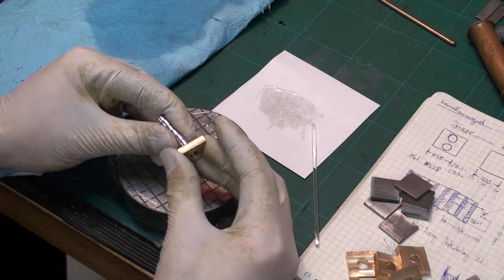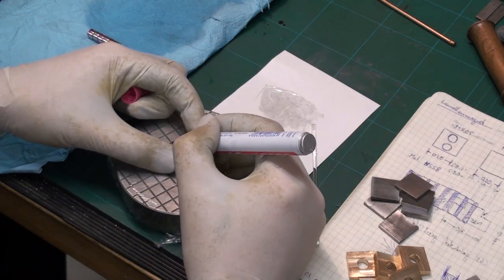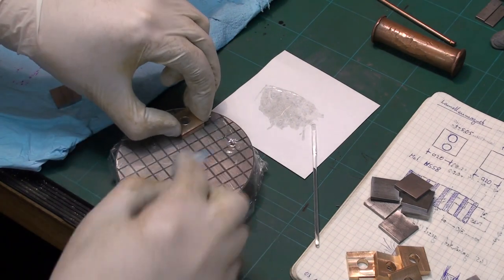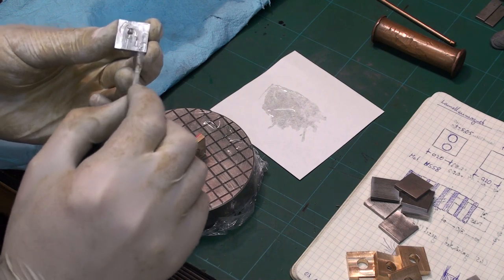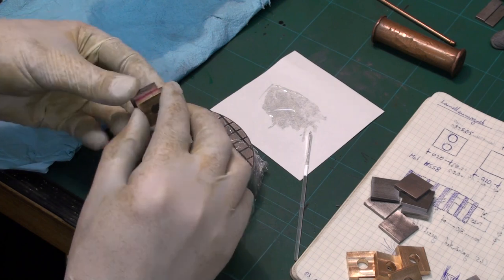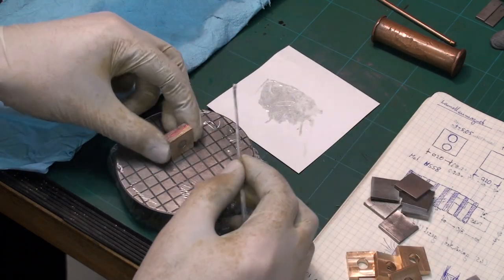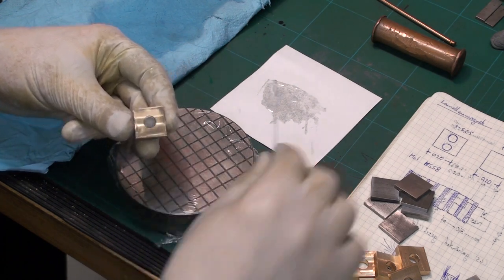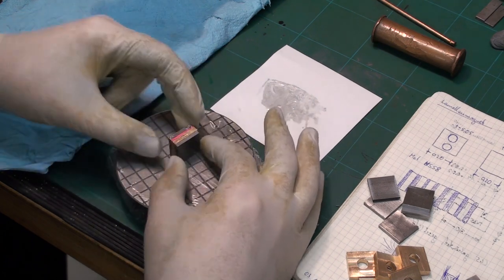And we drilled them pretty close, I realize. We might have to use a little help. But before we do that, I will mark the polarity on the brass too, like this. Now we take a small... There we go. Piece of paper, wipe off the excess, which wouldn't be necessary because we were applying more anyway. Now we take our first steel plate, or pole plate, spread some epoxy on it, and there we go. Try to align it, take our second pole plate, or steel plate, which makes it sound much more massive. There we go. Try not to get a piece of glove stuck in there.